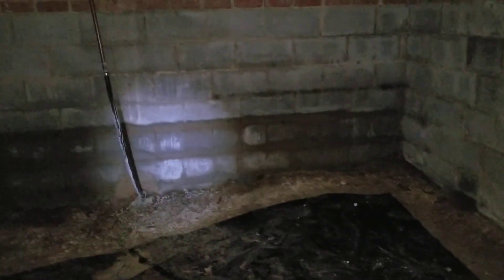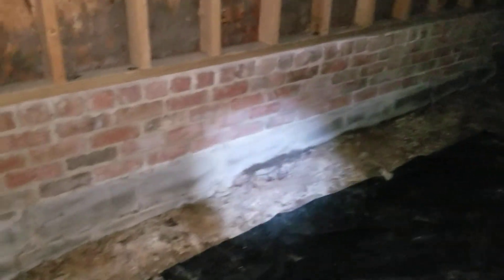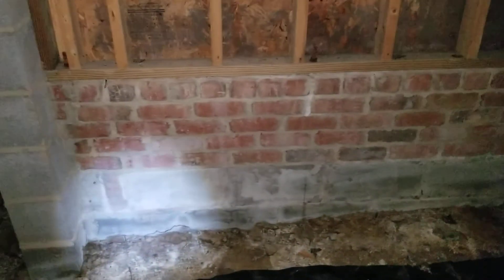I think that orange coloration is just the coloration of the OSB — I don't think there's anything about that. But this stuff is all very much moisture. We get to the outside corner and it's blocked, but you can see there's a lot of moisture coming through the ground. That's a lot of moisture — you can actually see it on the lower blocks here too, all the way up to ground level.